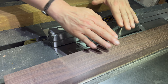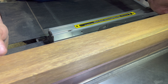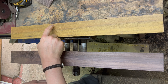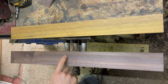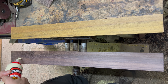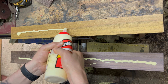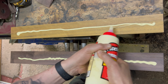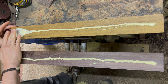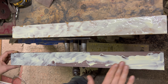So very dark brown and yellowy green — the green heart. I've just cut those on the table saw so you can see some saw marks here. A couple of thin layers of glue — I always overkill on the glue, I'd rather have too much than not enough. It'll all squeeze out; I've got a drip tray at the bottom. Spread that evenly along there.